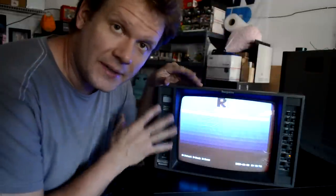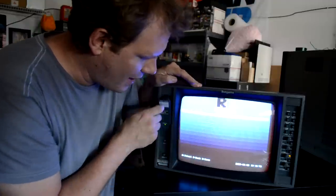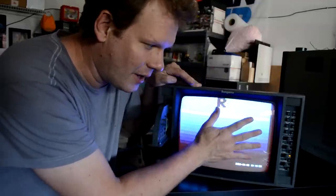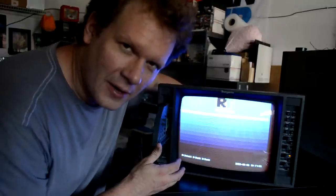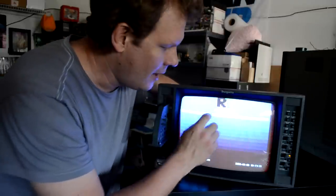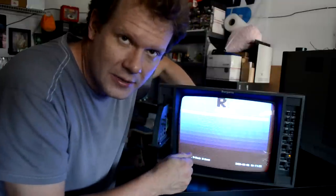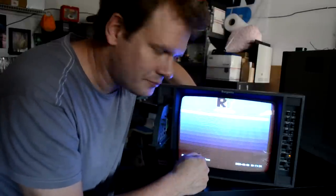The red color is not fully showing up. I can tell there's a little bit of background red — there are some red background controls down here, and if I adjust them I do see some red. I'm hoping the red color gun is not burned out on this tube. There are some potentiometers towards the back of the monitor that control the red, green, and blue levels. When I adjust green and blue I can tell the change on screen, but when I adjust red I get nothing. So I need to take it back apart and check out the red color line pathway — maybe one of the capacitors is out in an area I didn't replace.